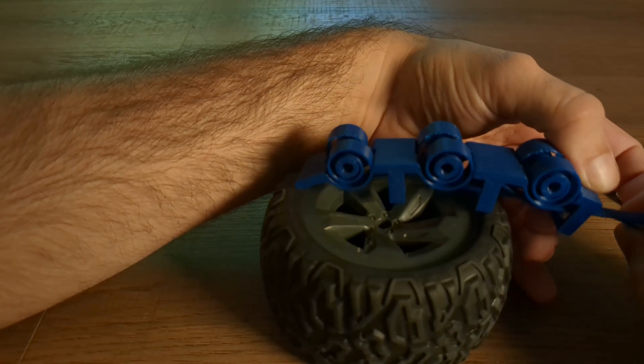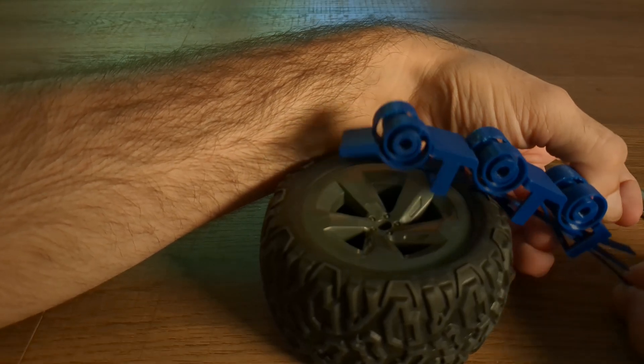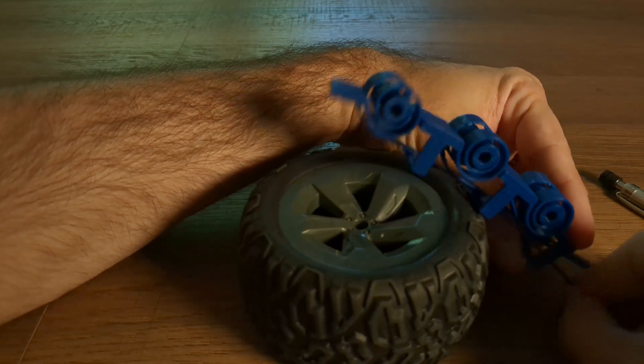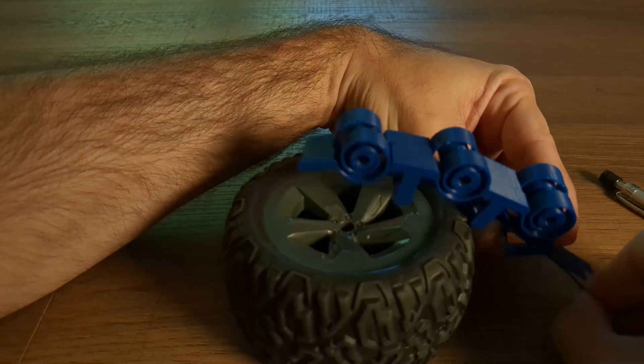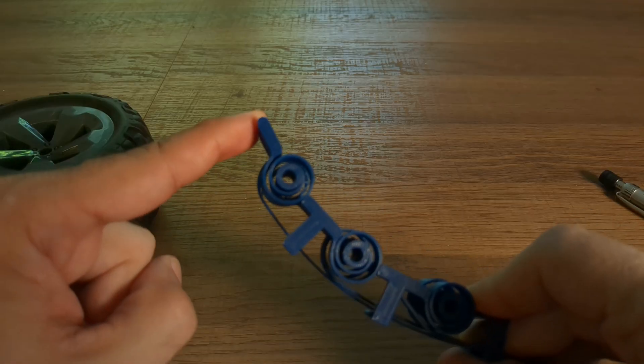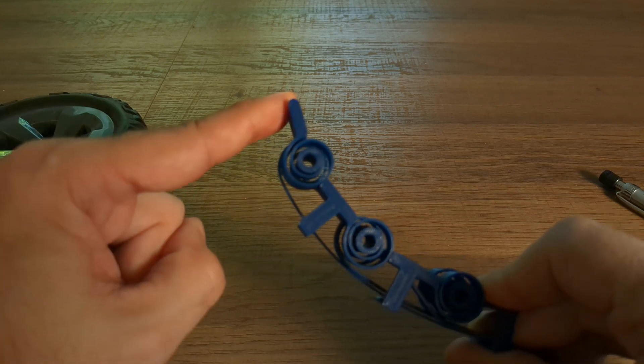Getting back to the full finger, we can see that it can grip objects adaptively — when one part of the finger encounters resistance, the rest of the finger continues to clench. Fingy is also back-drivable, meaning it responds compliantly when force is applied, instead of stiffly resisting and potentially breaking. Fingy needs more brothers and sisters before he can do a high five — right now it's just a lame high one.